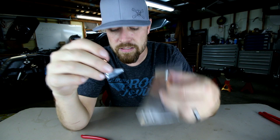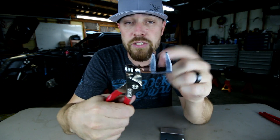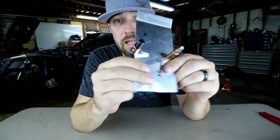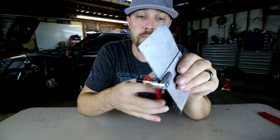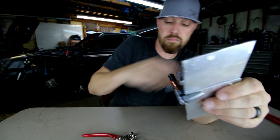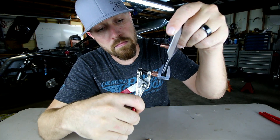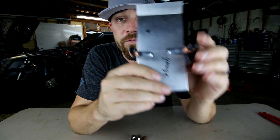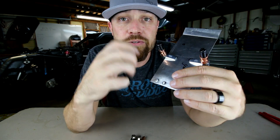Other than that, it works just like these. Use the same wrench. Give it a squeeze, the jaw is open. You just place it on the sheet metal. It clamps it in place. It's extremely strong — it's not going to let your sheet metal go anywhere. There you go. The Cleco clamps. They are great for doing exactly what a Cleco does when you don't want to drill holes in the material you're trying to fasten together.